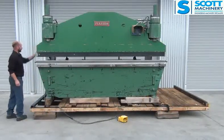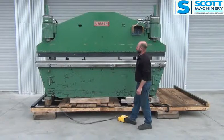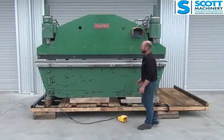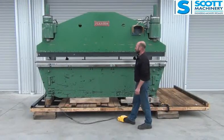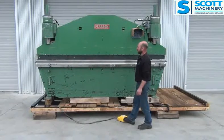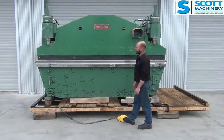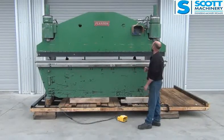Okay, we'll start her up. So I'll take it down. That's coming down there, and you'll notice just there it did the pause and then down. And then to go up, you just push it all the way down, take your foot off, and it automatically goes up, and you can see where it stops. So I'll do that again. Slightly push on the pedal, it comes down. If I want to stop, I can inch it down, and then it comes to that pause, and then if I put my foot completely down, it automatically goes up. So here's down, and that's the automatic pause, and then all the way down. If I do put my foot down, I can't inch it up, it's just an automatic cycle.